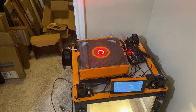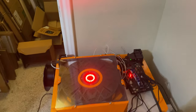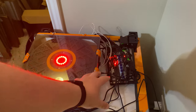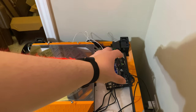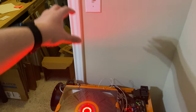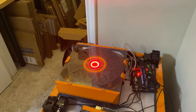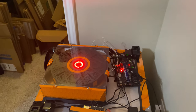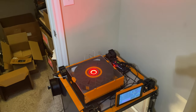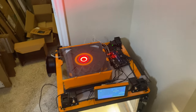Some side panels have a tendency to just pop out, and I'm trying to keep them in place with duct tape — but that's ugly and it's not even working. There is a panel holder I designed way back when I did this mod that I just need to print. I also want to show you the plan for the top electronics chamber skirts and extrusions — I haven't fully designed all that yet, but I have a rough idea. The Enraged Rabbit Project carrot feeder will sit on top on some extrusions, and the carrot patches will be on yet another layer on top. I have a nine-channel carrot feeder, so I'll need nine filament holders.